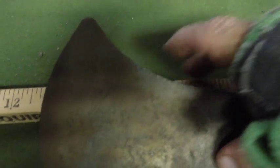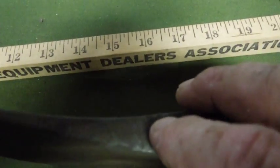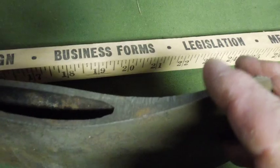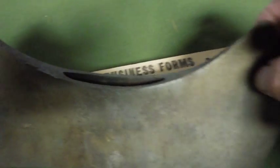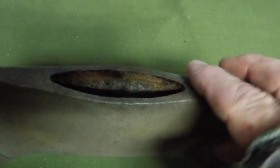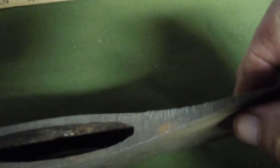And then I start looking for damage. This one's in really good shape. Right along this surface here, it has some hammer marks from where it was knocked off a handle in the past. This is typical — they did a rough grind right after they finished forming the head, and the same thing is true up along this surface. So one of the first things I'll do is put it on the belt sander, smooth all of this out, do a little bit of grinding to knock these hammer marks out, and then smooth this out with the belt sander also.